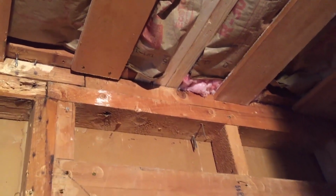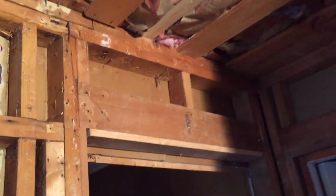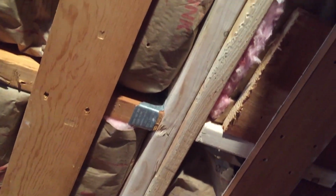It's just two 2x6s. It's sitting on this wall and then sitting on the old gable wall. It actually kind of raised the ceiling up because this wall that was here sank a little bit. So I raised these up and put everything where they were supposed to be. Joist hanger there, some 2x6s to the other ones, tie them in, and so I could put strap in there.